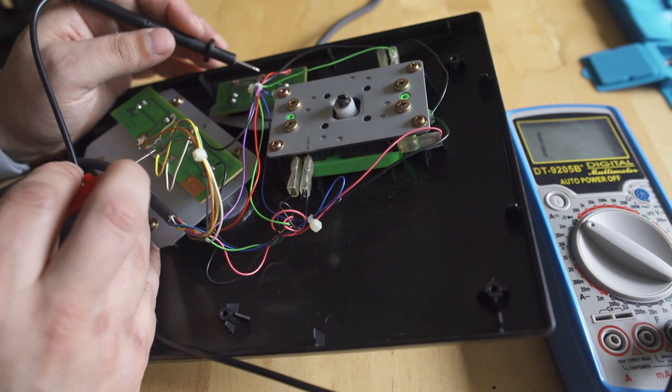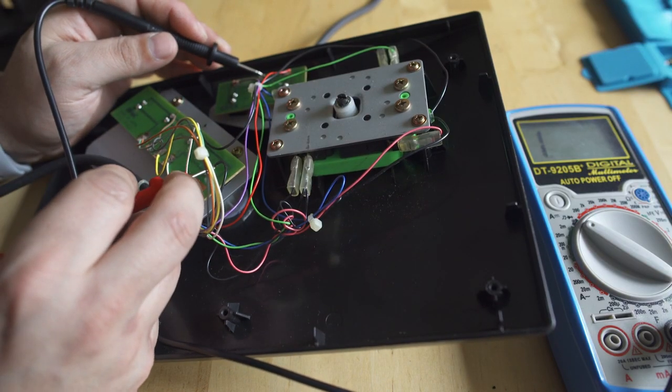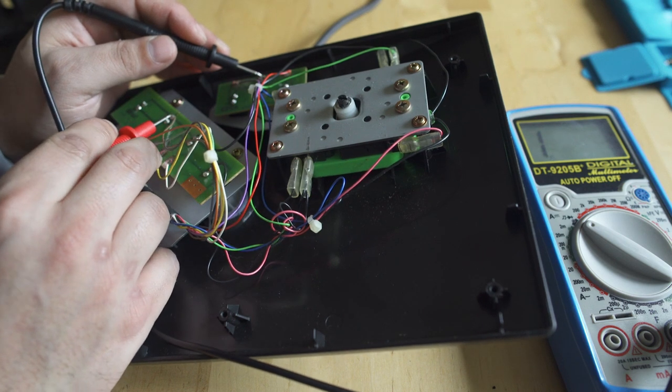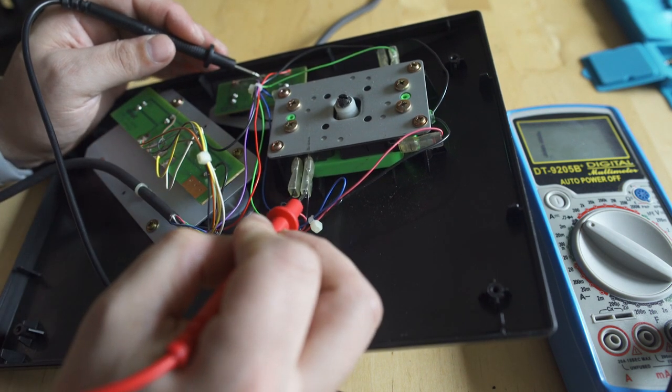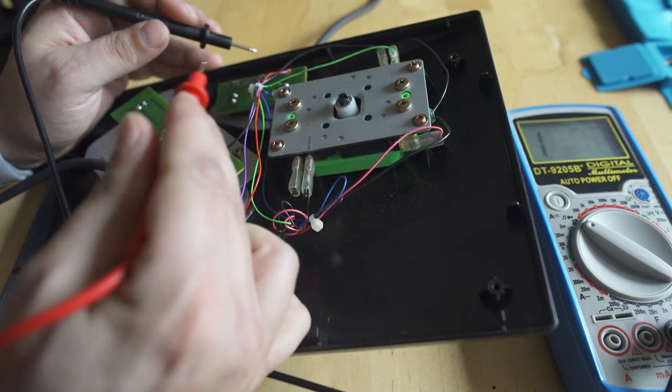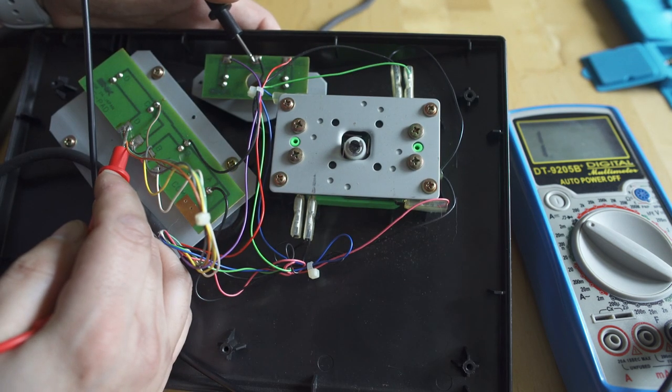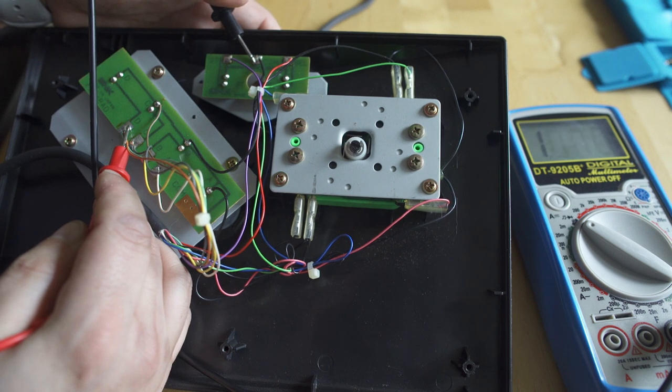But you'll see here, when we use our multimeter, we're going to check and see that there is a common ground between start and select, between the buttons, and between the stick itself. And we will maintain that common ground when we put those Sanwa buttons in. But that's basically how it works. If you hold down a button and go from ground to the signal, it will have continuity, so we know that's working perfectly fine.